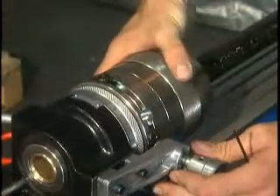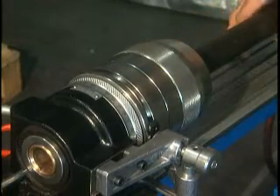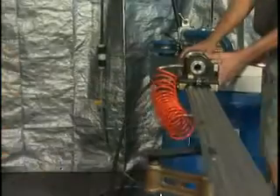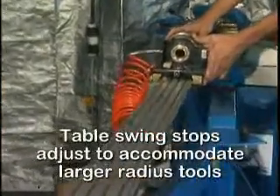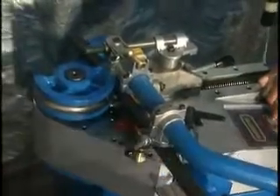The operator maintains the bend plane by lifting the locking pin and rotating the chuck to the desired stop. The table swing stops adjust to accommodate larger radius tools, minimizing table movement during the bend cycle.